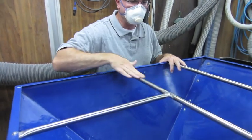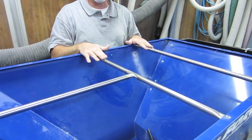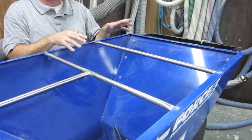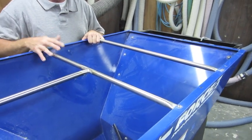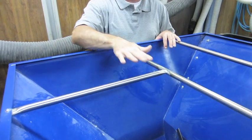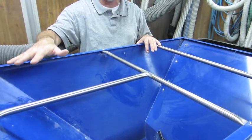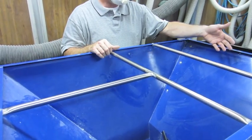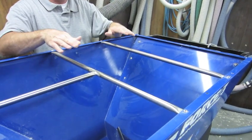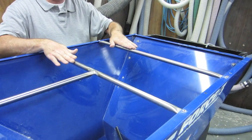The first enhancement made is with the bars on top of the hopper. You will notice two configurations. One side is a T configuration, which can be used like a shelf to stage your product. The other side is a straight bar — this is the side where individuals will load product into the hopper. Product should be loaded from one side consistently to obtain optimal feeding and prevent bridging.